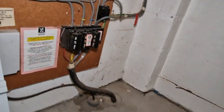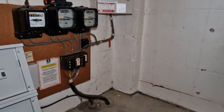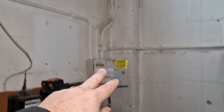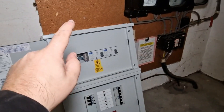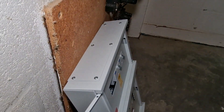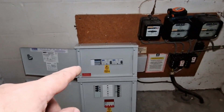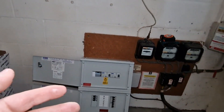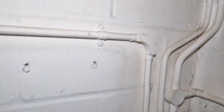I've got an isolation range so the fuses can be pulled — they are cut and I am approved by the DNO to pull them, but I wanted them to come and look at this so they're coming anyway and can make the isolation. I can strip this back up and out the way for the time being. We'll have to see how that drops in — if I can, I'll get the tube straight in the top of the DB. It's a low profile one, we've used these on jobs before and they're really shallow which is nice. I think the plant room job I showed in a school was when we were short of width, and we went for this as a good solution.